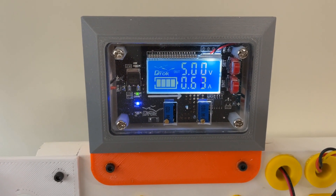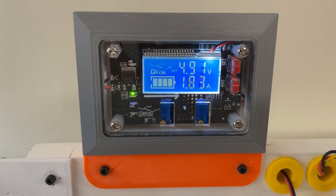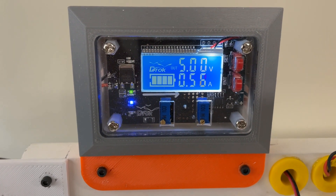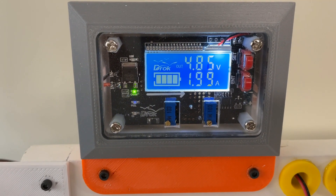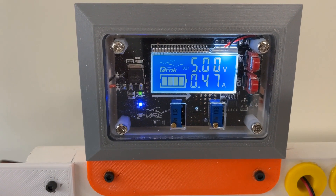I've done individual servo testing and some of my really high-torque servos in the 400 ounce-inch range will pull up to about 5.1 amps — that's the most I've ever seen from any servo I've tested. So that needs to be a really robust system when you're going to run servos like that.